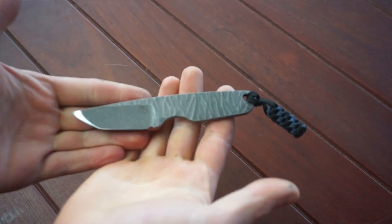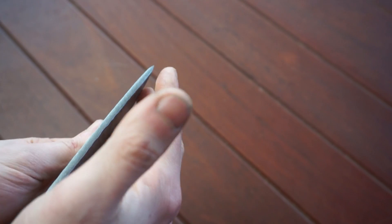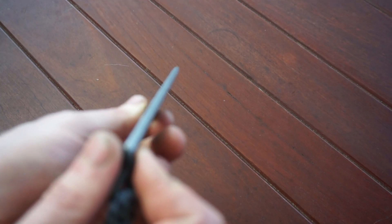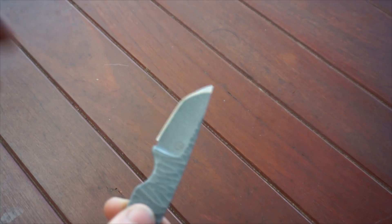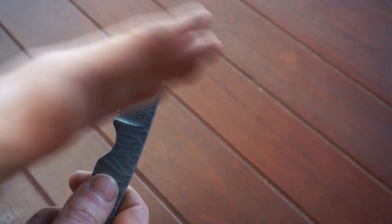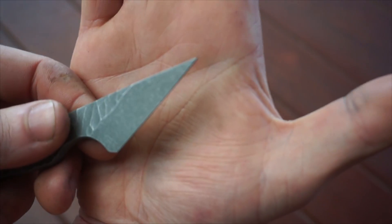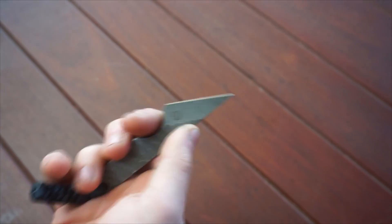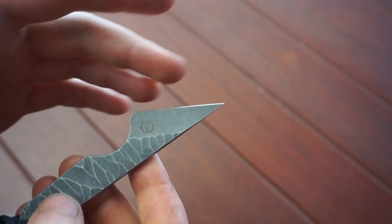Actually the second one here - I actually came from one of these too. What I was doing is I was grinding it and I ground it off center, so instead of being in the middle, this tip was about a mil or maybe even two mil off, which just made the knife look drunk - which isn't a good look. So what I did was I just busted out the angle grinder and cut off the front of it. This was all annealed steel, very early in the process. So I cut the front of it and I reground it into this little guy. It's just a straight up nasty little point - kind of like a kiridashi mixed with a contender. I did cut the handle down a little bit too, so it's a very compact little knife.